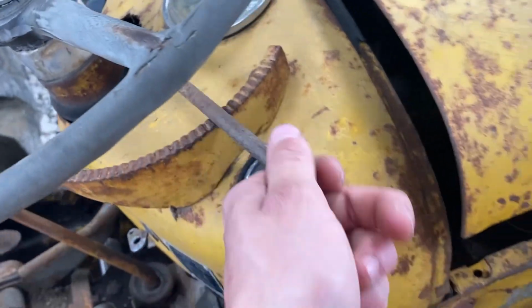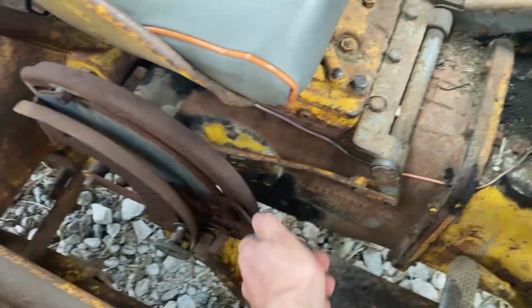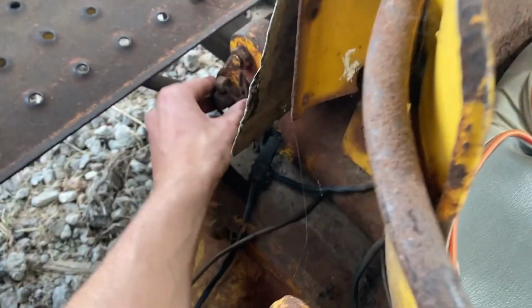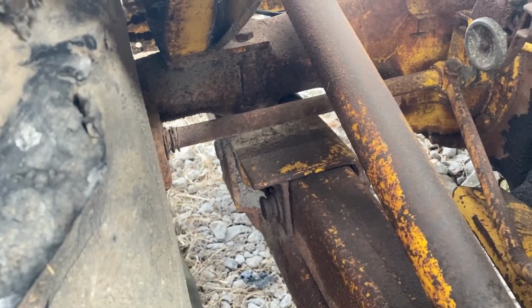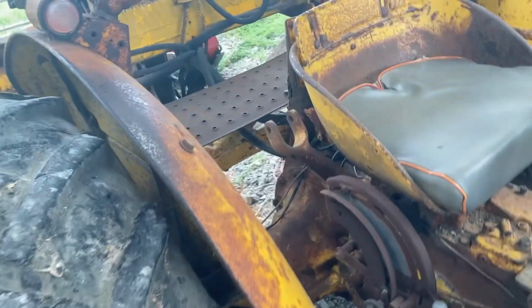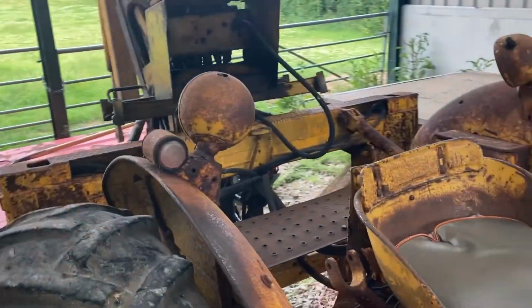A little ratcheting thing to hold the throttle in place when you're on the digger. It's got all the linkage, the top cover and a PTO, which I think in its life's been used because all the pins aren't seized. But as you can see, it's a 35 back end, so it's only got the one set of mounting points, whereas this one's got two. It's just that little bit narrower, so it's quite handy. There's a couple of little jobs which we can't quite fit that in, so this one will.